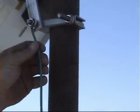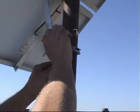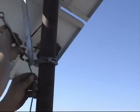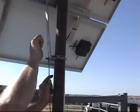We're attaching a copper wire for our ground to our aluminum mount on the panel using the wind brace piece. If you're using a two panel system without a wind brace, you can attach it anywhere on the aluminum mounting structure.